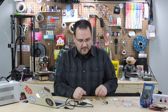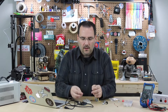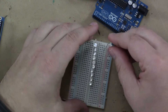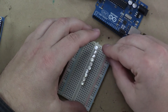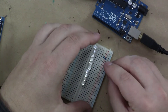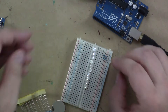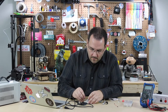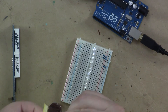There are all my LEDs. Now to make this compact and easy, I'll use the 220 ohm resistors instead of wires for connecting the grounds. All the odd rows are positive, so my grounds would be row two to ground and then follow suit all the way down with all the evens. Four to ground — it's going to get pretty messy in here, but we're just prototyping so it doesn't really matter.